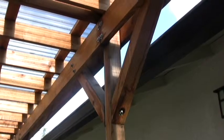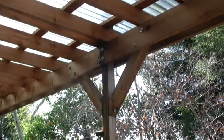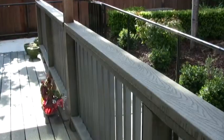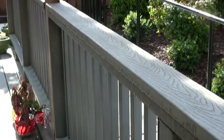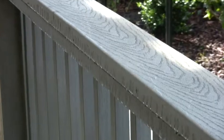Other decks are made with treated wood, which makes them resistant to termites and dry rotting. But to maintain that resistance, you should reseal the deck and railings with a high-quality water-repellent sealer every two to three years, depending on the weather conditions. A lot of rain may mean you should seal the deck more frequently.